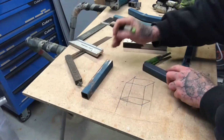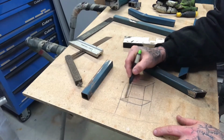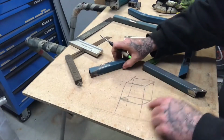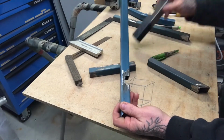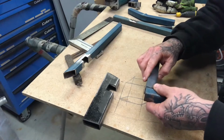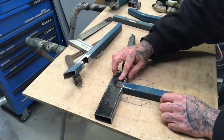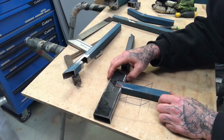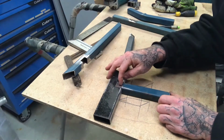So how I normally do it, even most of my shelves are just timber, but I make the actual shelf frame as its own piece. So that rectangle, and then I actually countersink it into the leg. So whether you're using 25 by 25 or 25 by 50, I've done a little demo of either. So imagine this is your frame, however that's joined together. Well, it actually goes inside of the leg. So even though it gets fully welded, it's actually sitting on the metal. So even if your weld does fail, which is highly unlikely for shelves unless you're moving them around a lot, it's actually got some proper gravity helping it, not just a weld.